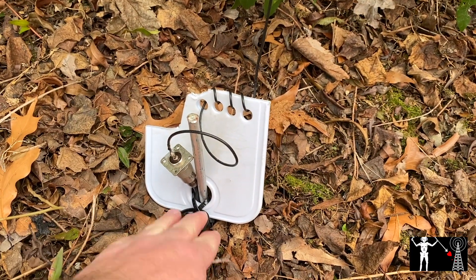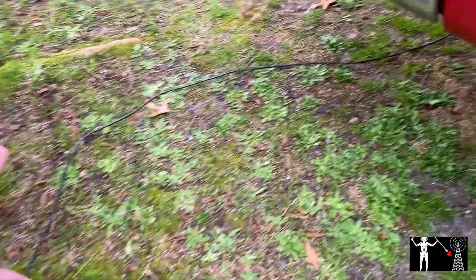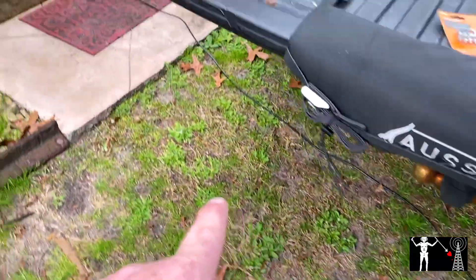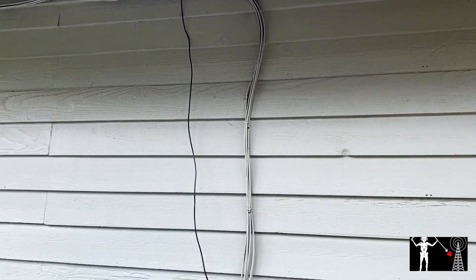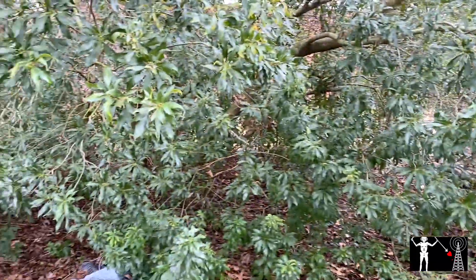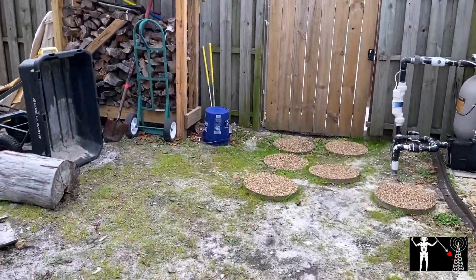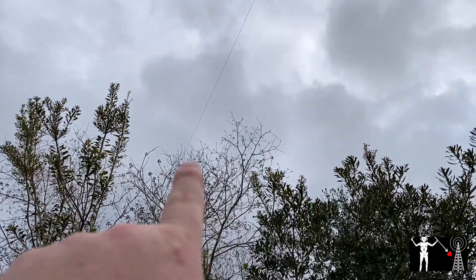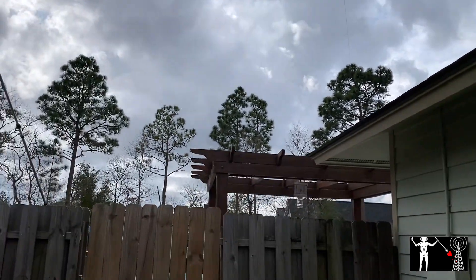I currently just have it zip tied down — it is touching, which hopefully creates the ground circuit for the counterpoise for the wire. My coax is running right now, just haphazardly laid out into the shack. That's my other coax going to the other antenna. I'm going to run the new wire to the switch — I was just trying to get it tuned. Last night there were solar flares and crashes, so I don't want to do anything too crazy yet. But you can see the antenna coming out of the top of the tree, stretching all the way back to that other tree.